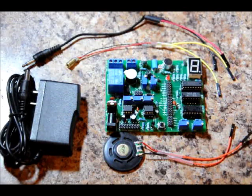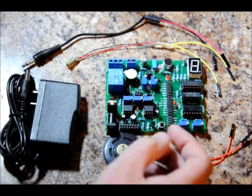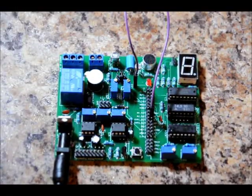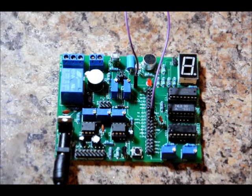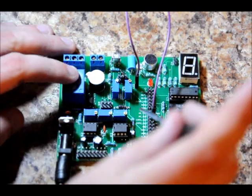When you get your board, there will be instructions in video form and also a quick document describing what each plug-in is. You have tons of options. Let's talk about a 7-segment display driver circuit. To drive our 7-segment LED, our first block is our monostable multivibrator — our pulse lengthener — based on the 555 timer. I press the button and that LED turns on for a short period of time.